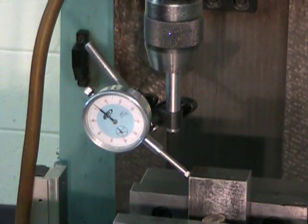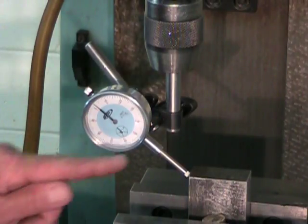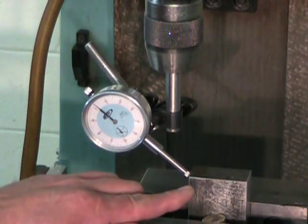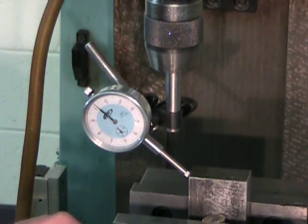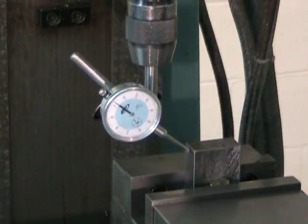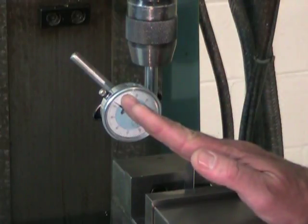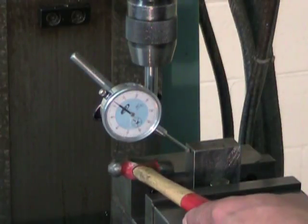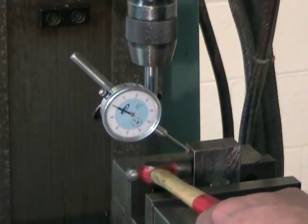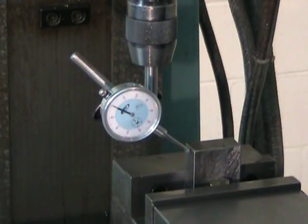I can see here that my indicator is a couple of lines out. I'm talking lines and not dimensions because my indicator isn't perpendicular to my surface, but it's still a comparative indication that my part can be adjusted a little more. The direction of the dial's movement indicates to me that the part is leaning slightly towards the dial indicator, so I'll adjust that very lightly, and then I'll re-verify to ensure that I've corrected the problem.